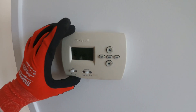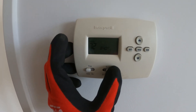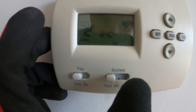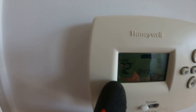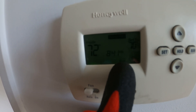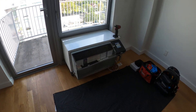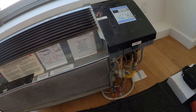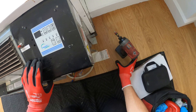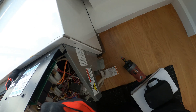It's not exactly summer time and it's not exactly winter time, so we're not in the exact season, but we're going to test both heating and cooling. We're going to start by setting the system to cooling. It's 72 degrees in the room and we dropped it down to 70. I just heard a click — we have a steady cool on, and nothing is happening. These units are tricky, so let's open up this panel.